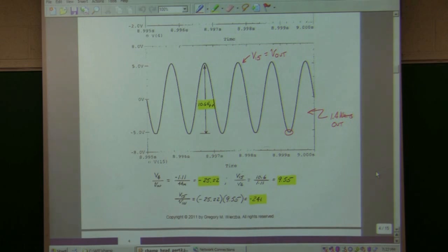But that's part of the advantage of having a simulation. I actually calculated what transformer I really needed to hook up. And I don't have exactly those windings. This 45 to 1 just came with it. The ones I bought for the kits have 4 different windings, so you can try different combinations. But I can calculate which one will give me maybe the overall best results in maybe an 8 to 16 ohm range. For those that are building the amps, I'd like to do a little bit of a lab with you where we play with some of the measurements and see if we can tweak out a little more power.